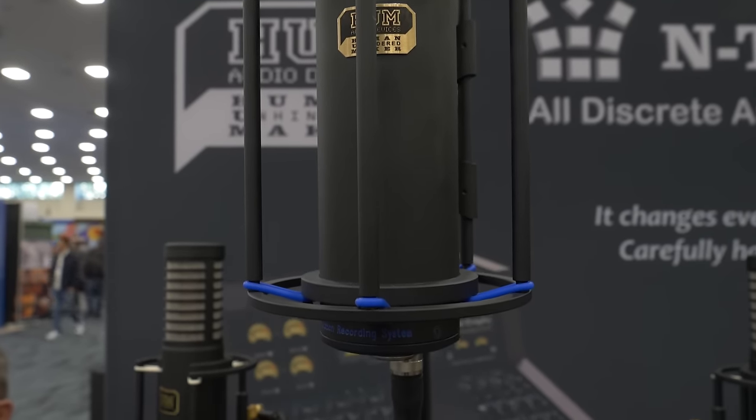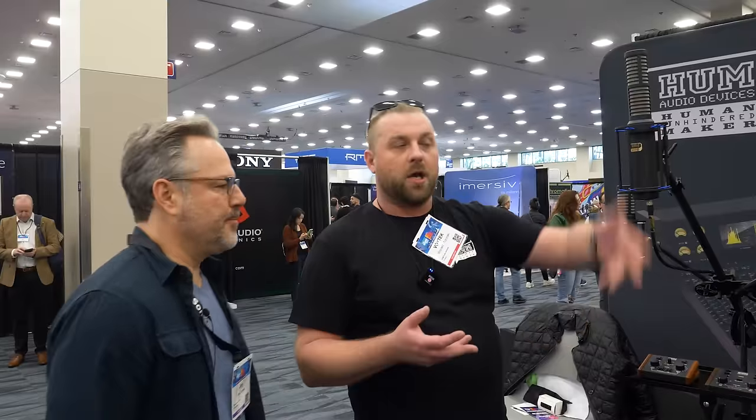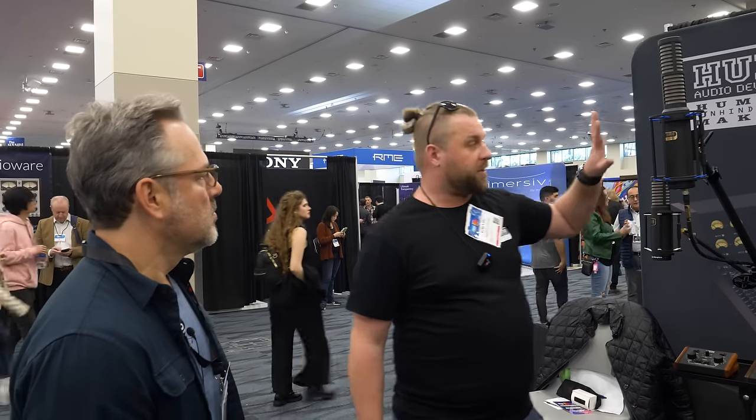That's my background, classical music recording. A lot of times you put it in a room 50 feet up in the air. It's 80 feet of cabling, and ribbons usually require more gain than mics. With that kind of setup, there's going to be noise. So right now you have an inch of a cable. Because of the built-in preamp, it's going to spit out line level, so you can have it anywhere without introducing any additional noise or problems like that.